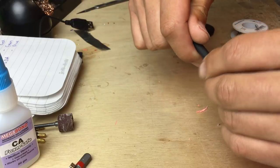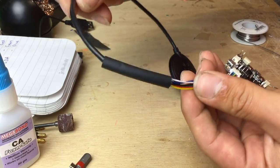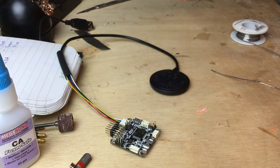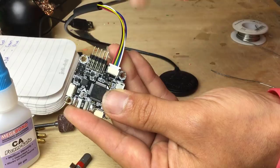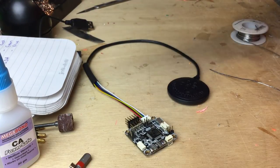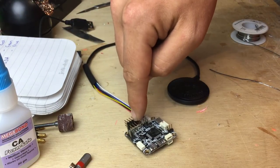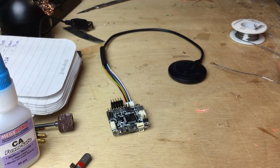Push the heat shrink tubing down over the connectors, blast with the hot air gun, and that's the GPS unit fully connected up. My biggest tip: plug your connector into the board so you know you've got it the right way up. From myself Matt — thank you for watching this episode. The soldering is the hardest part of this entire iNav series. If you can do that and solder up the wires in the right order, that is happy days. Cheerios!